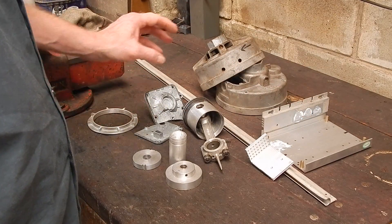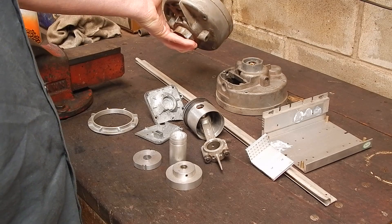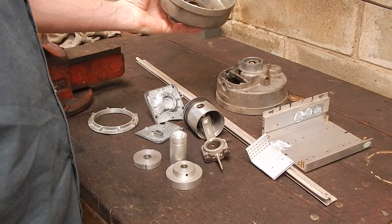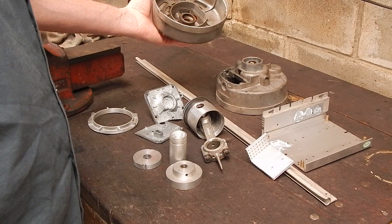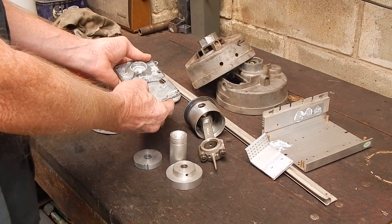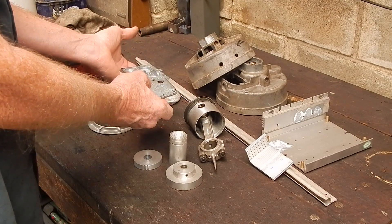Now let's look at what is good to use and readily available. Here is some good stuff — this is the end casting off an electric motor, just an ordinary old fridge-type AC motor. They tend to have an aluminium end on them at each end of the field windings. That's good stuff. If you try and bend that, it will break rather than bend, and that would have a very high silicon content compared to the softer stuff. Here's an example of some aluminium that came out of an old treadmill motor — you can see it's snapped rather than bent, and it's quite heavy.